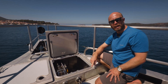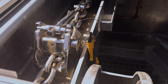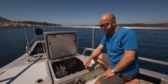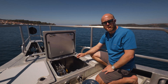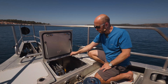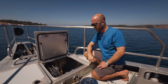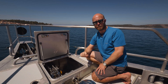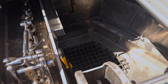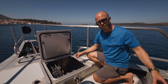You'll also note there's a knife here. At the very end of the chain is what we call the bitter end — a short length of high-strength synthetic fiber rope connected at one end to the structure of the boat and at the other end to the end of the chain. If you needed to let your entire anchor chain and anchor go in an emergency, you can safely cut that line and let it go, minimizing risk and making it as quick as possible. With that top access to the anchor locker, you can see the chain and check for any knots or fouling, and you can also access it from inside the boat.